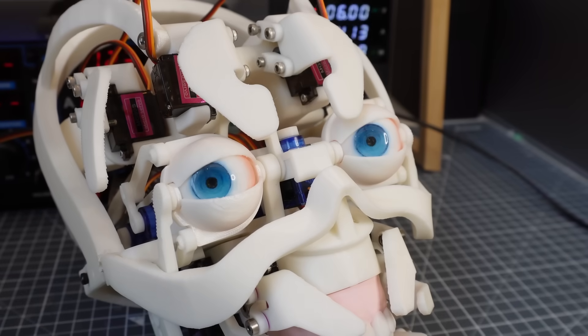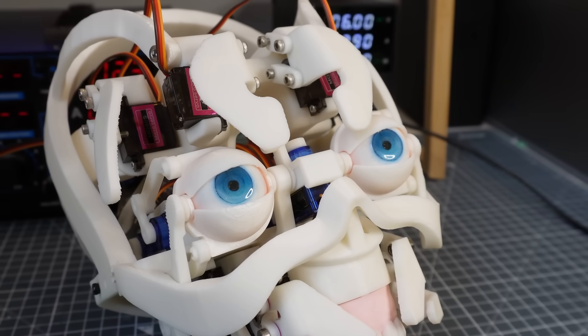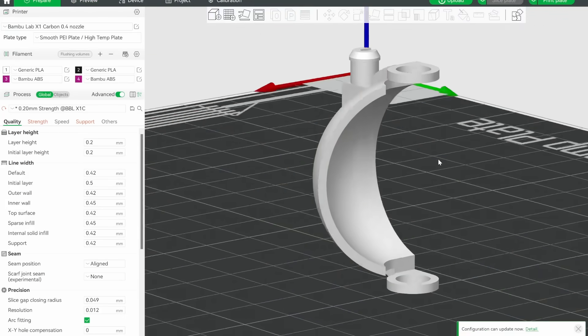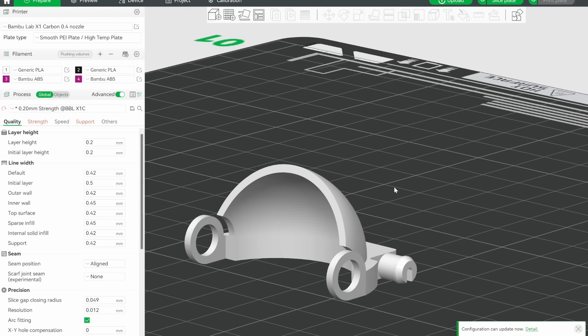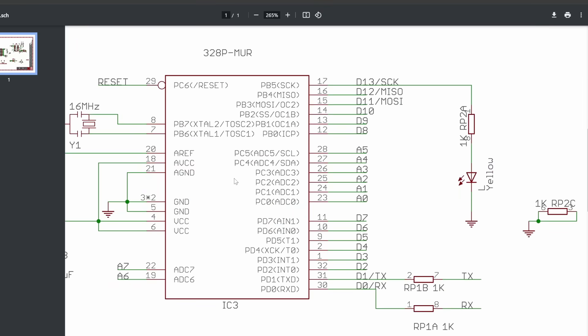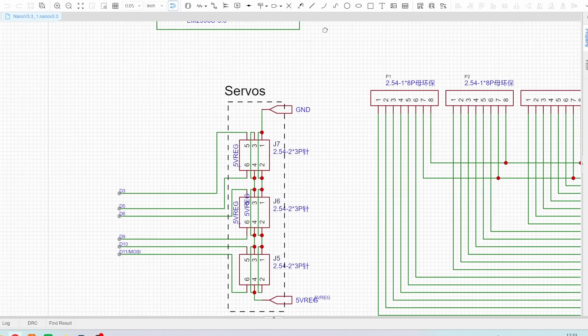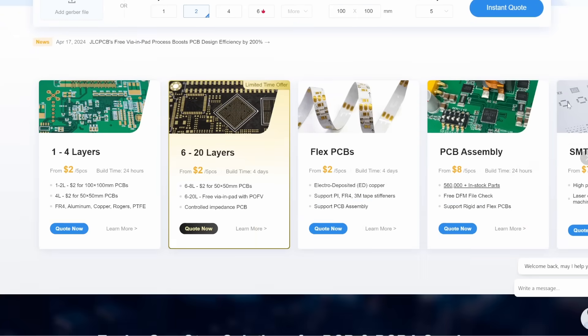The eye mechanism I used in this design is the snap-fit one I showed a few months ago with a few minor tweaks and improvements. I didn't like having to print the eyelids on their side, especially because the snap fit on there was one of the most prone to breaking, so I added a slight flat and aligned everything onto one face so I'd be able to print it lying flat with a lot less issues. There are still some things I'd like to improve, but the main thing I experimented with this time was the PCB. I wanted to try directly integrating a microcontroller chip onto my own board rather than it being an Arduino shield, so I downloaded Arduino's open-source schematics for the Nano board using the ATmega328 and squished it together with a voltage regulator and servo power circuit I made in the last video.